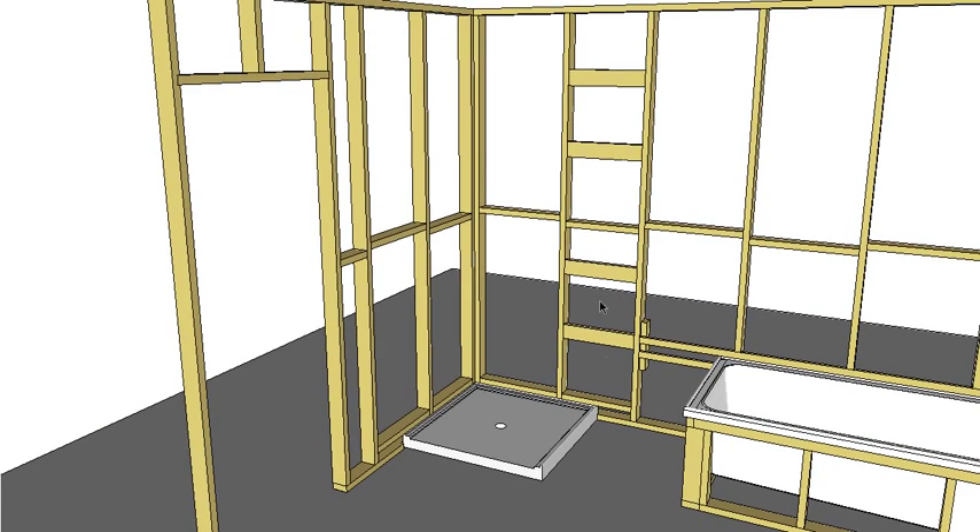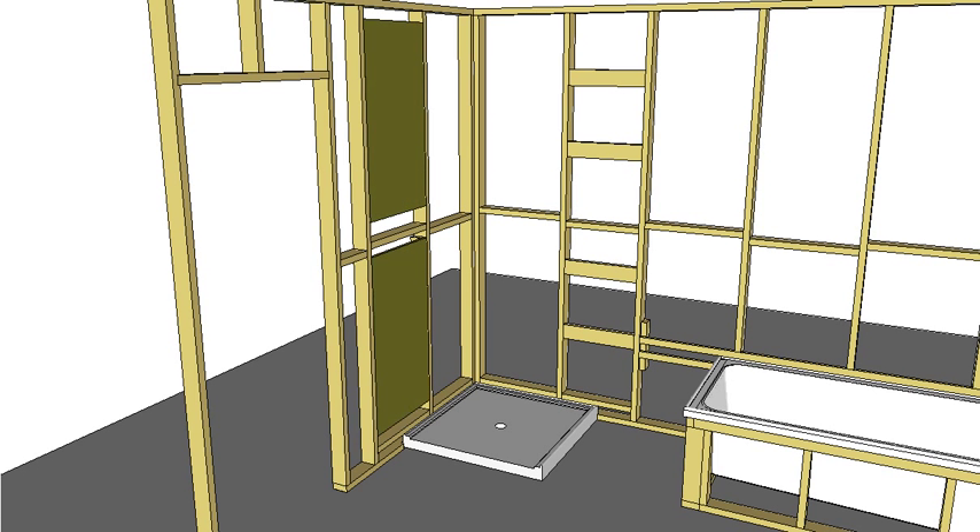Depending on what you're going to have, you might have a shower screen up this side. So you're going to have to have some fixing for the shower screen. Some people might put a single stud up there — that could be hard to find. Some people put multiple noggins, which might be easier to find. A common option nowadays is to put some blocks in — so for a 90mm wall, put 70mm blocks in and then just nail sheets of structural flooring or ply between the studs. That way you virtually can't miss the noggin and fixing your shower screen will be quite easy.